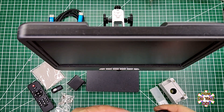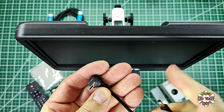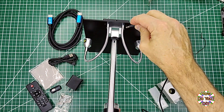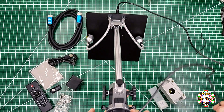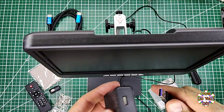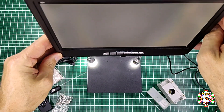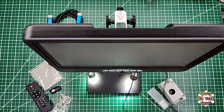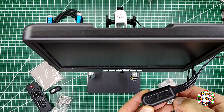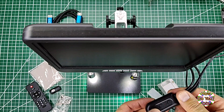Now I'll show you how to use this digital microscope. Let's start with the power cable. There are two plugs to connect to the microscope: the USB-C plug and a barrel plug. The USB-C plug goes into the port on the back of the screen. The barrel plug goes into the port on the base to power the two adjustable auxiliary lights. You won't always need those lights because the camera gets a good image with just the built-in ring light. The other end has a standard USB-A plug which goes into the power adapter. On the power cord there's a dongle with three buttons: one is a power button, and the other two adjust the brightness up and down for the auxiliary lights but do not affect the ring light on the camera.